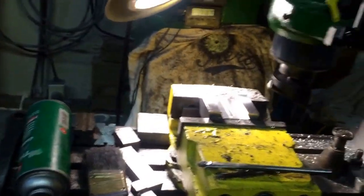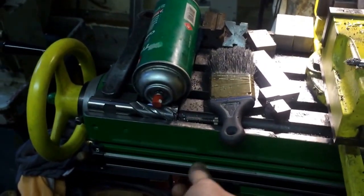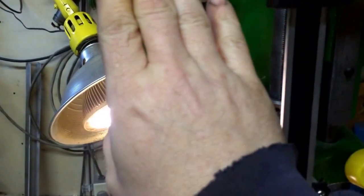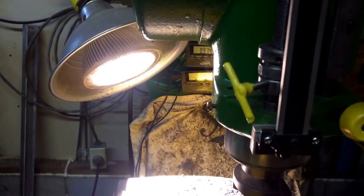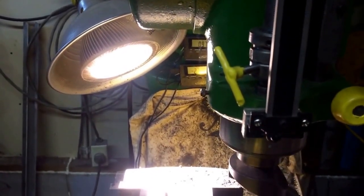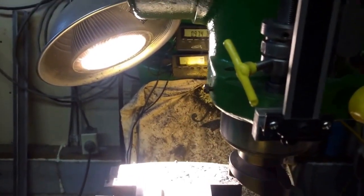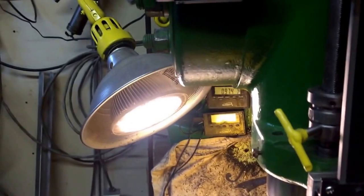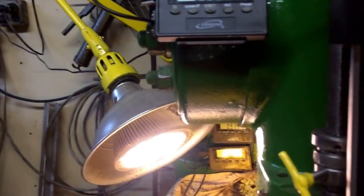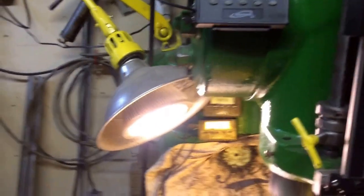I hope that helps anybody looking to buy them. The DigiMatic scales are made out of aluminum instead of stainless like the Accu Remote, and they aren't quite as accurate. The Accu Remote over the full length of a 38-inch scale only loses about two thousandths for repeatability, while the DigiMatic is like six or seven thousandths over 38 inches. So if you have the extra money, get the Accu Remote — it's a much better scale. The Accu Remote is on the lathe and I may never replace them, or if I do I'll move them to the mill. I won't get rid of them — they work pretty nice. Alright, have fun YouTubers.